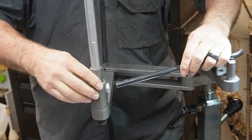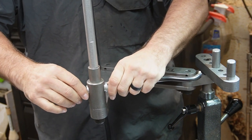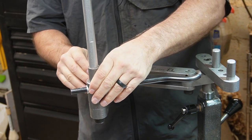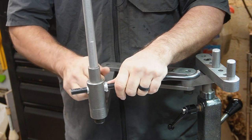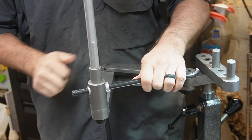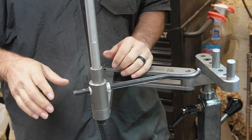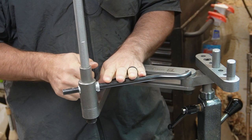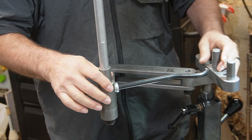I can put the half inch tool in the adapter, leaving enough sticking out so we can put a handle on. I need to make sure that tool is nice and level — the cutter should be flat, with the top of the cutter parallel to the bed of the lathe. We're going to tighten up that set screw, and now that's installed. I can put a handle on, but I'm not going to for the demo. It would then use the same tool rest.